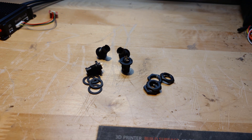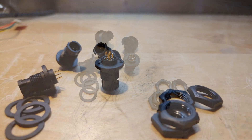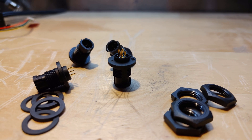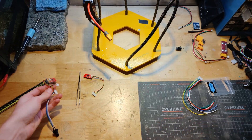The last thing we need to take care of is the footpad connector. Luckily this part is available to purchase on Digikey for a reasonable price, so we don't need to fabricate something ourselves. The only slight difficulty is wiring up the pull-down resistors.